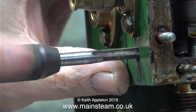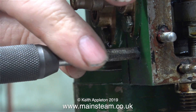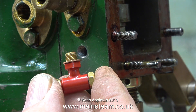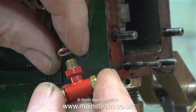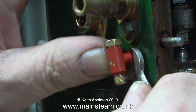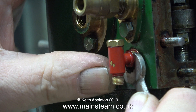A clack valve is also known as a check valve, and whatever it's known as, it's a one-way ball valve. Here's the one I'm going to use — this is one I've had in my box of small check valves for quite a while, made by Chris English of CME Engineering. This is Loctite 542 thread sealant. I've coated the threads in Loctite 542, and here I'm screwing the check valve into position using a couple of shim washers to make sure it sits at the right angle.